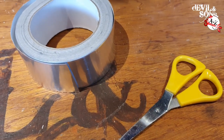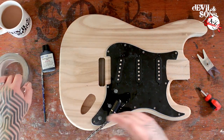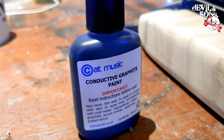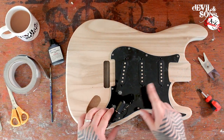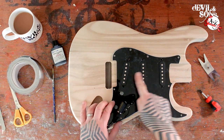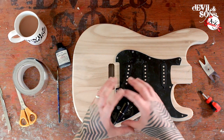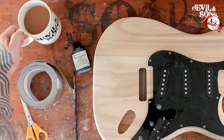So I'm going to do one test with no insulation inside at all, then one where I use aluminium foil on the inside, and one stage where I'm using conductive graphite paint — this one from Cat Music. That's three different tests: no insulation, two different types of insulation. And then at the end I'm going to see what difference it makes if I also insulate the pickups. For now we're just insulating the cavity and the back of the scratch plate where the controls are.